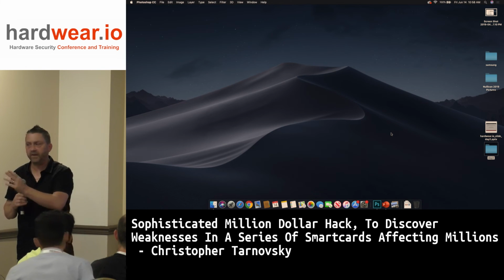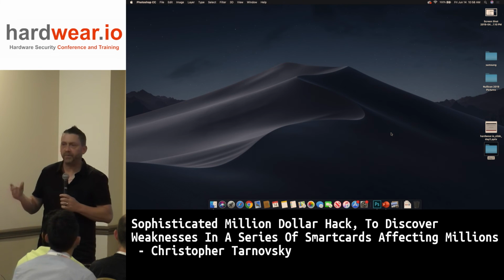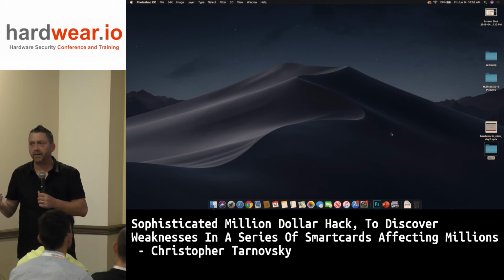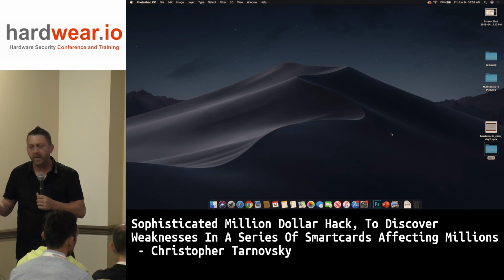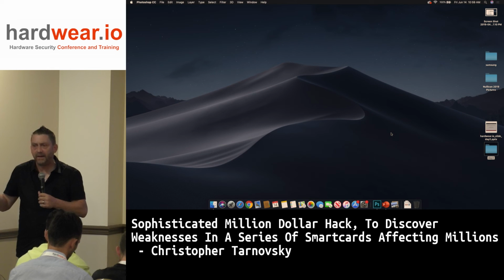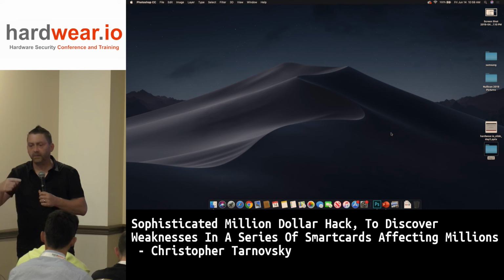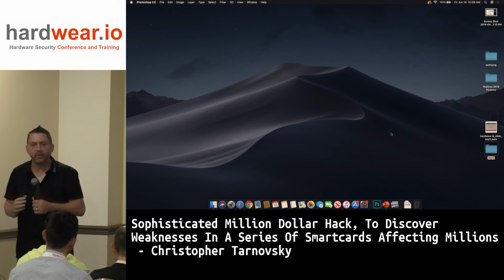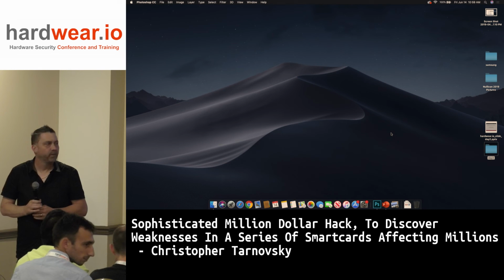And so I capture each bit, because whenever I'm capturing the data on these chips, it's with one needle. If I'm using 5 needles, it'd be like on an old ST chip, like an ST16 back before I had the FIB. So it'd be one needle on the shield to fix the shield, because the shield was just VDD back then. It was just a VDD line going across the entire chip. And then one needle for the clock and one needle for the data bus bit. And I don't even know why I'd need 2 more. But that's it. Oh, maybe one to glitch it or something. Yes.